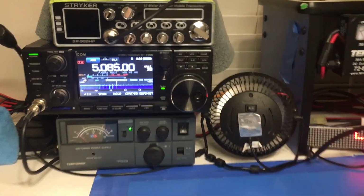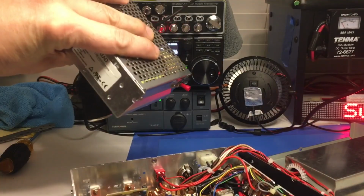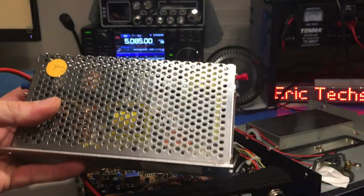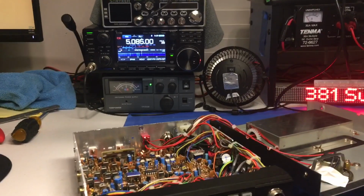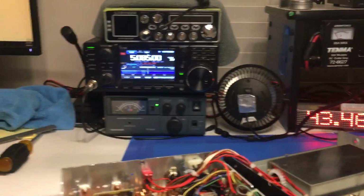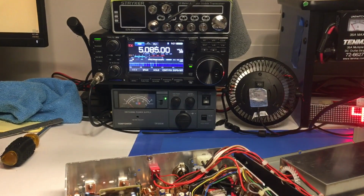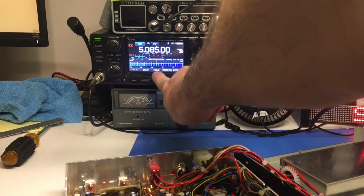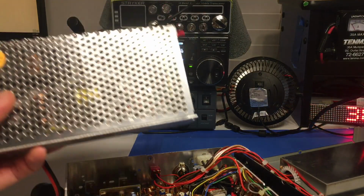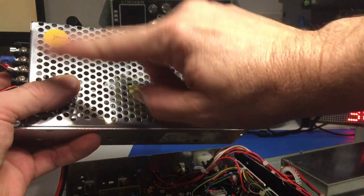You know what that is? That's my old power supplies. This was as a smaller version, but you know those brick power supplies, everyone's using LED drivers? Well, as soon as I turn mine on, it will destroy this band, and you can't hardly even hear anything. So you see that turn back on, boom, across the board. Now, not all of these are made the same. Some of them actually do have some AC filtering in it.